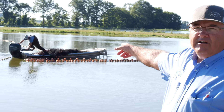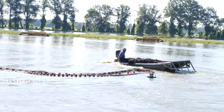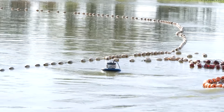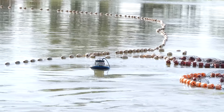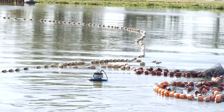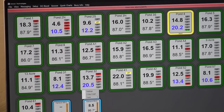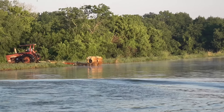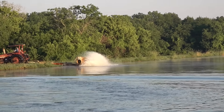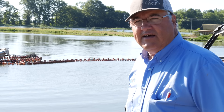We see the little floating thing on this side of the boat — that is our oxygen buoy, and that measures the oxygen in this pond every 15 minutes. It turns on the electric aerators as needed, and sends the message back to the house. We have a computer at the house and at the office that tells us what the oxygen is. If the electrics don't hold it and it goes down, we have to put a diesel aerator in to keep the oxygen up where it needs to be. They'll just pick the seine over the top of this buoy and keep on seining on down through here.